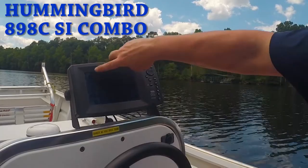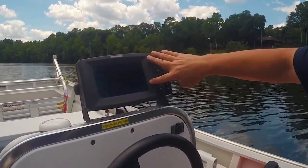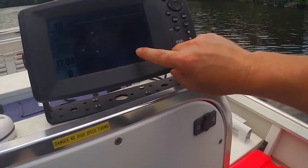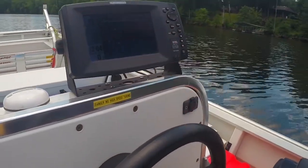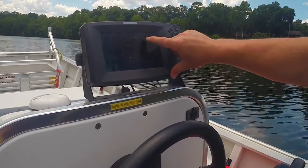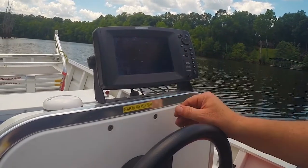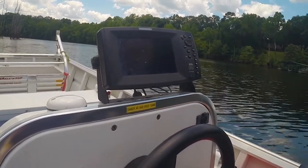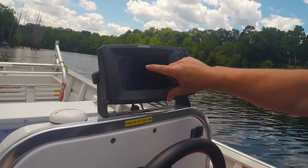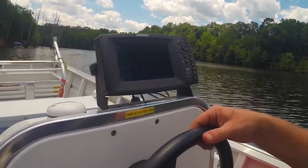The screen gives you your current depth and has depth markers at 0, 7.5, 15, 22.5, and 30. This dark area right here is the bottom of the lake — it's a straight line coming down, not a flat area. This right here is the water column, and over here is our boat. As time goes by and the boat moves, it ticks this way, adding to the image already there.